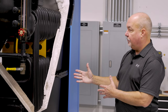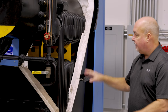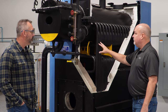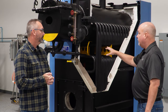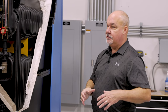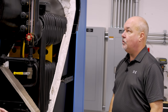But not unlike any other piece of equipment, water quality is critical. You've got to make sure you take care of your water because we have a lot more bending, and it can create deposits if you don't keep up with it. You'll find these in a lot of really big hot water and heating applications. Not that they can't be put into processes — I have put them into some distilleries, mainly because those distilleries are doing start and stop and don't have 24-hour production. This is a very good choice for that scenario.